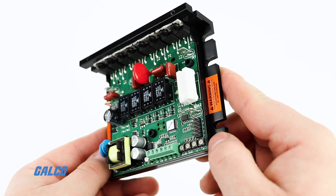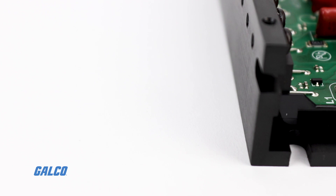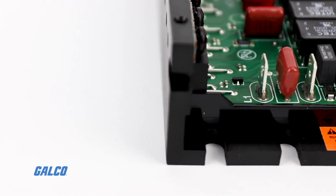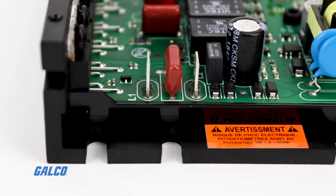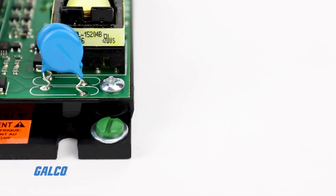The traditional logic-containing adder card has been removed, resulting in an overall height reduction of 33%, allowing the MGB400 to fit into control panel spaces that most regenerative SCRs cannot.